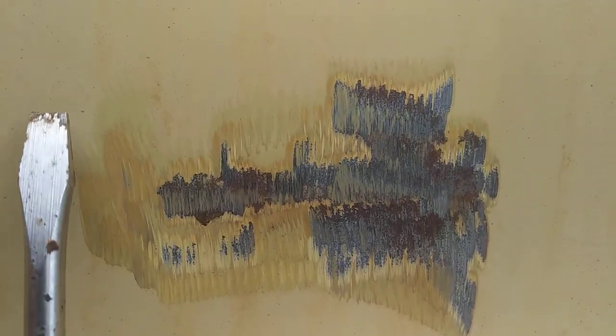What I did is I took an angle grinder and removed all those rust chips and some of the damaged paint. You want to be careful to keep some of the original paint — you don't want to grind whole areas because there's basically no reason for it. You just want to grind off all those chips and get all the damaged or rusted areas removed.